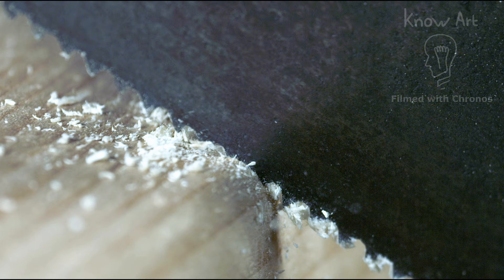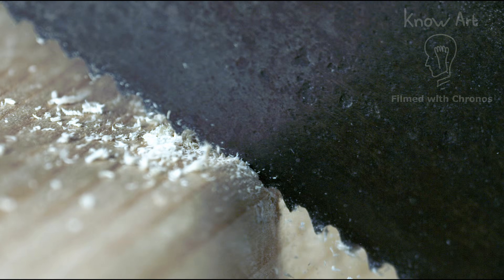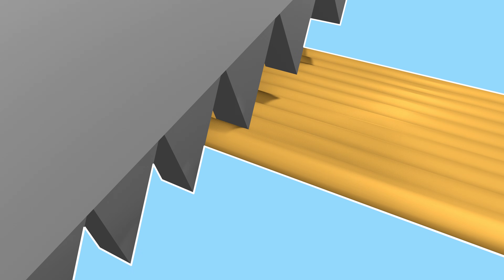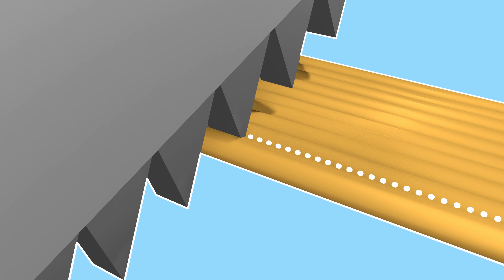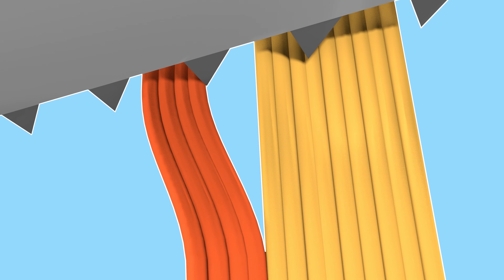This is a dovetail saw and it has tiny rip cut teeth, and it doesn't tear out that much. The sides of a ripping saw's teeth are just square — they're not really going to cut anything on the side without a fight. So it takes a bite and starts to push against the fibers. The connection between the fibers then fails first, which creates a small lever, and this lever grows until the bite breaks. When you take a bigger bite, you still separate just two fibers while combining the breaking strength of that fiber bundle. So with bigger bites, the lever needs to be lower for the connection between the fibers to overcome the breaking strength of the bundle. Because this saw takes very small bites, the tear out is also very small.